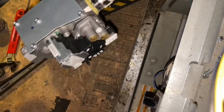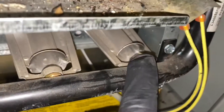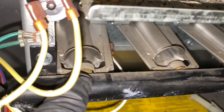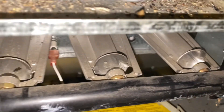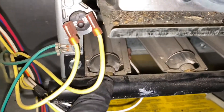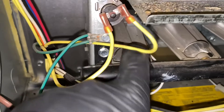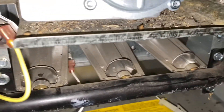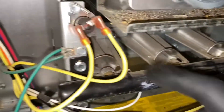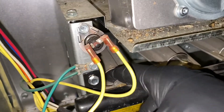All right, we've got the new valve in. Put all four screws in. Important thing is to make sure all the orifices are inside each burner. You wouldn't believe it, but I've found some furnaces where another repair company was out there doing something and didn't line these burners up.